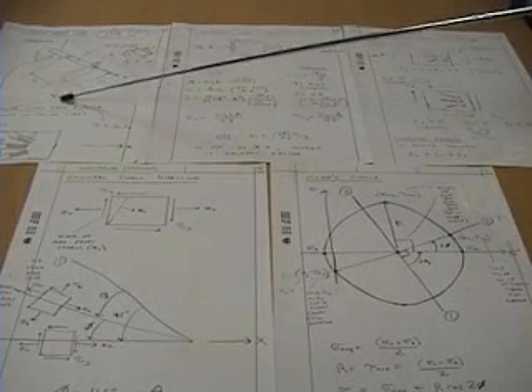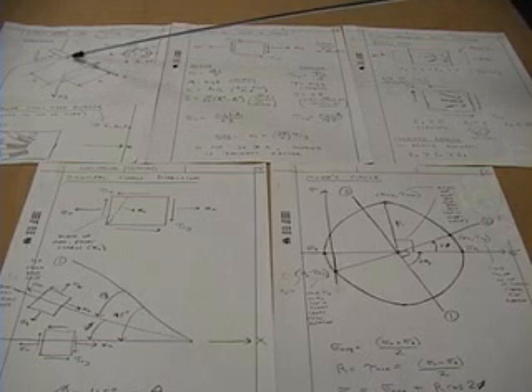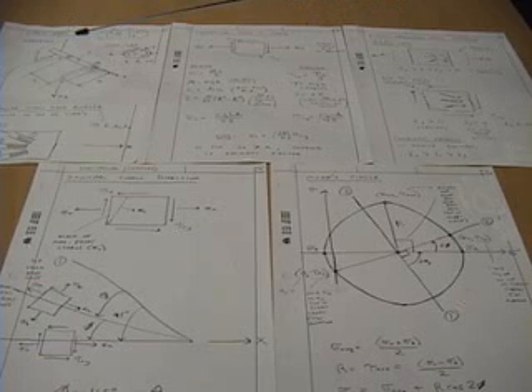Now I'm going to summarize the procedure carried out in lab to utilize readings from the strain gauge rosette. We first apply a mass to the end of the tube, which creates a state of stress on the top of the tube that we measure with the strain gauge rosette. We measure the three voltages coming from the strain gauge rosette — one voltage for each gauge — and calculate the strains corresponding to those voltages from the strain gauge bridge equation using the gains properly.